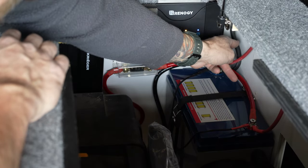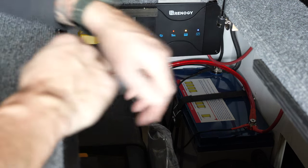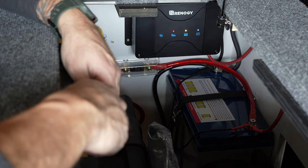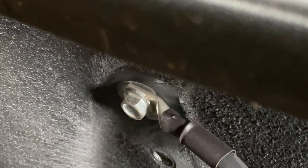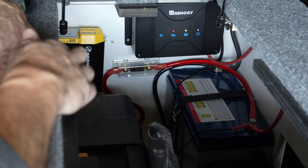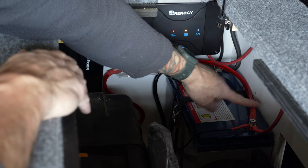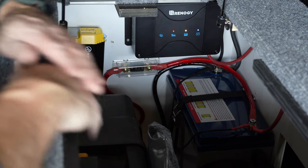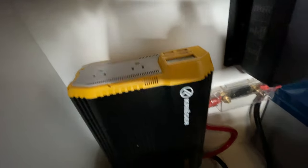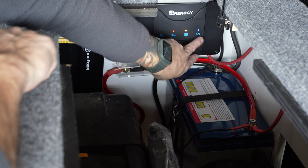This is a ground — I got really lucky with this one. It goes from the battery to the side of the bed. I took off a tie-down, ground off some bed liner, and bolted a quarter-20 bolt right to the side of the bed. Works great. The inverter was very simple to install — the power is screwed in right here, and the ground is right over here. I actually have four wires connected to the ground on this battery, and it's screwed to the wall.